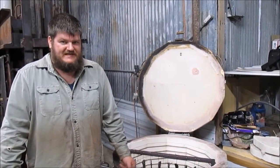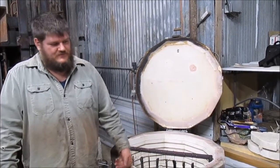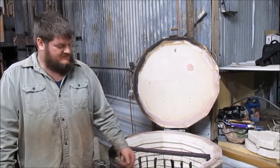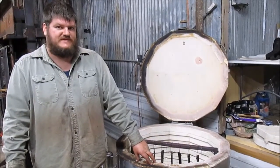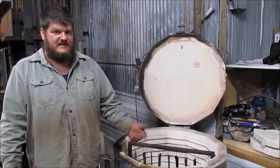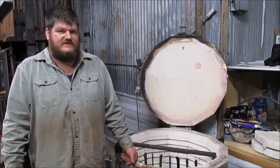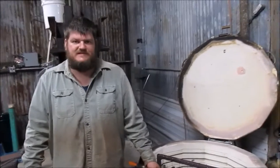We're gonna do that by heating it up for an hour. When we quenched it, it was over 1500 degrees. When I'm tempering in the kiln, I don't really have anything that goes over 600. So a lot cooler. We'll do it for an hour, it'll cool down, and then I'll do it for another hour, it'll cool down, and then I'll do it for another hour. So for a total of 3 tempering cycles, and make sure everything gets transformed.